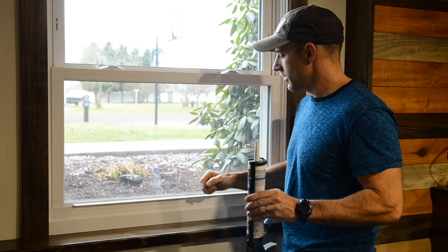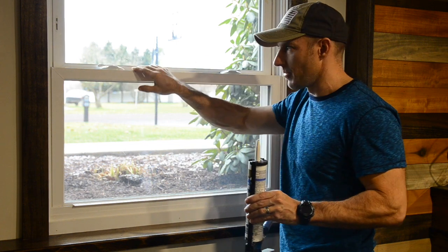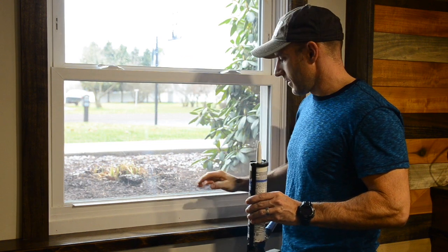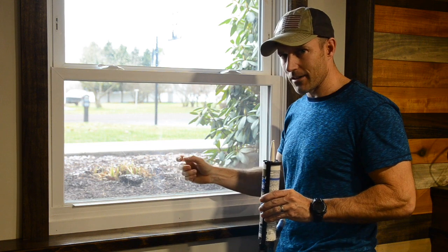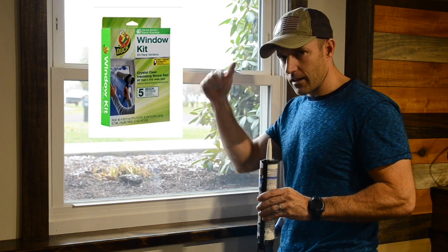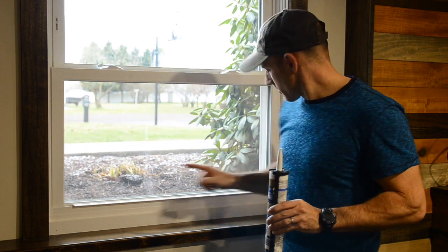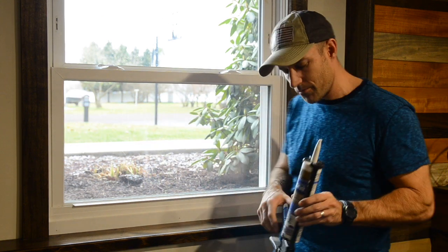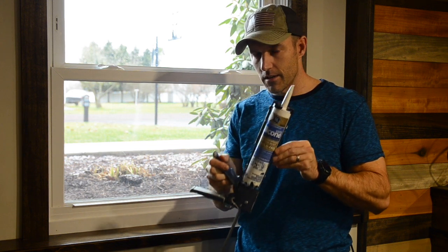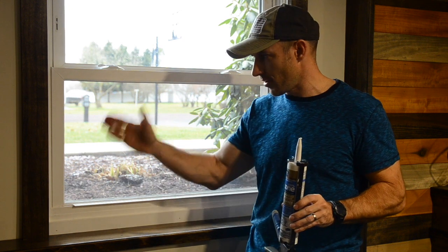You're also going to want to check your windows. I've found through the years that if you lock your windows it helps seal them up better, at least if you have vinyl windows. If you have a single pane window you're definitely going to want to put plastic over your windows — I'll put that down in the description. Down around the seals of the window where it does not move, you could put some 100% silicone — not caulk. 100% silicone. This stuff is a lot more flexible; if you put caulk in there it's just going to crack.